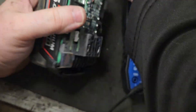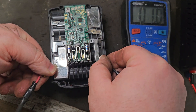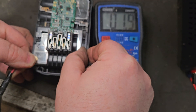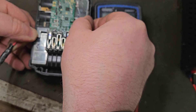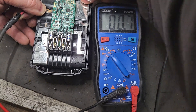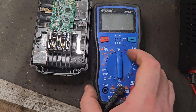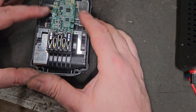If we take the top off and remove the screws, we can see what it's showing across the cells: 1.8, 1.8, 1.8, 1.8, 1.8, 1.8. So we're getting equal voltage across the cells, but they're just at a terminally low amount of voltage across the battery. They're equal to each other, however it's far far too low.